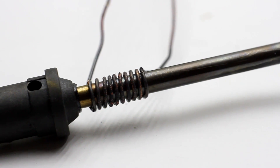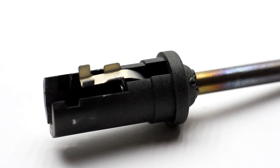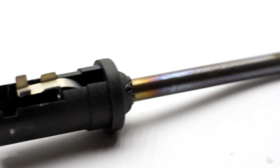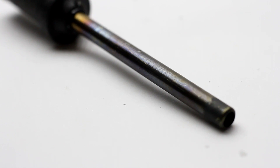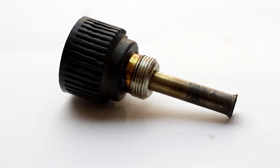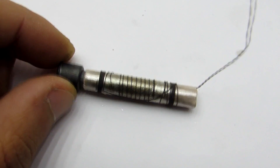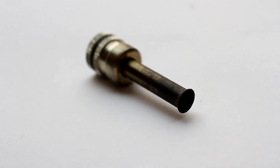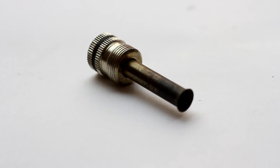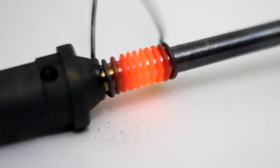Let's start with the heater — and this is not an inductor, but an iron pipe. My version is taken from an industrial soldering iron, on which a Nichrome heater was wound. There are a lot of options for execution. Similar parts can be found in old soldering irons from stations, in ordinary cheap soldering irons, or you can do it yourself — just take an iron tube with a base. The base of my sample is plastic, but it is heat-resistant, and during tests it has proven itself the best.